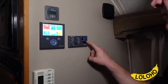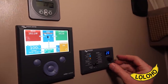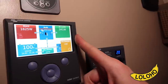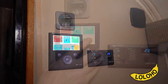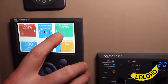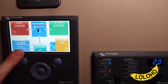I dialed down the current limit on our Victron multi-control to 15 amps, so we're bringing in 1600 watts of shore power. Now let's see if I dial the current limit to 20 amps if that makes a difference. Now it's working! Champy Jr. is mostly powering our air conditioning. We are drawing about 70 amps from our lithium onboard — the compressor has just kicked in. Our air conditioning unit is pulling about 1160 running watts and we're getting about 1200 watts out of the generator. It's taking that electricity from the generator, powering our air conditioner, and also keeping our house batteries at 100%.